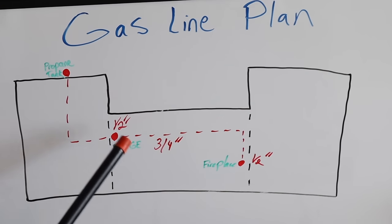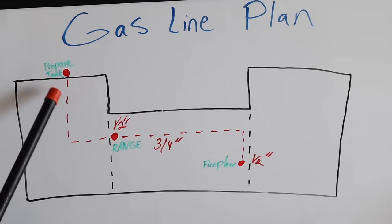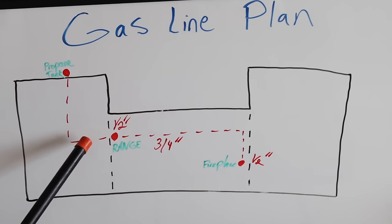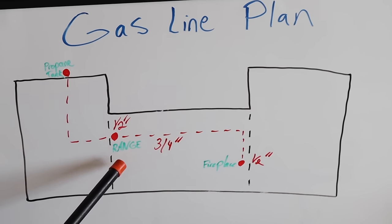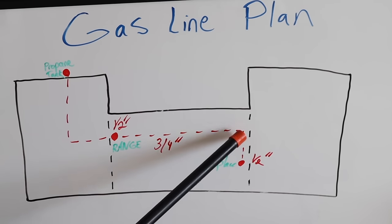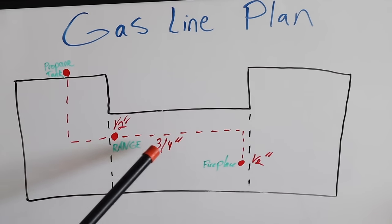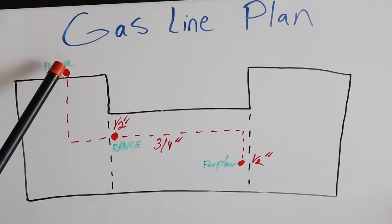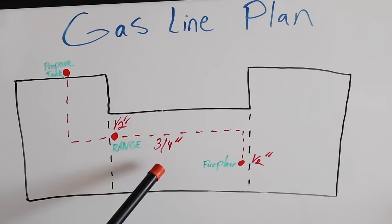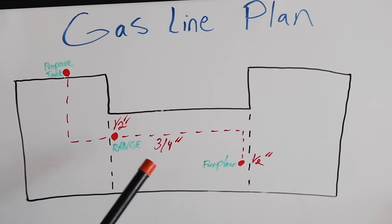Here's an overview of my gas line plan — a quick outline of my house that I'm building. The fireplace is here, the range is here, and the propane tank will be setting over here. I've got a line going from the fireplace past the range and then out to the propane tanks. I'm doing a trunk-and-branch run: three quarter inch pipe is the trunk — the dotted line — and the circles are where half inch pipe stubs up through the floor to pick up the fireplace and range. Then I exit the house with the three quarter inch pipe to hook to the propane tank. Pipe sizing for me was fine with three quarter inch pipe — that's something to research when you first learn how to run gas lines.